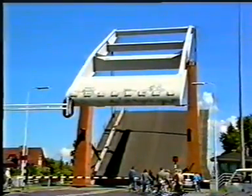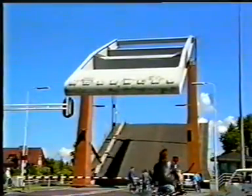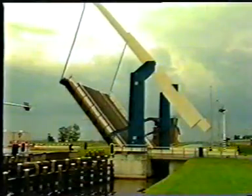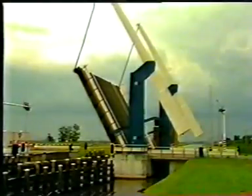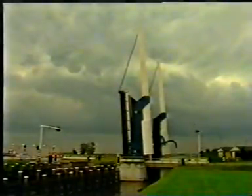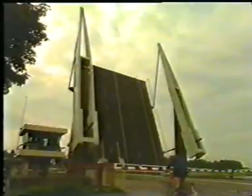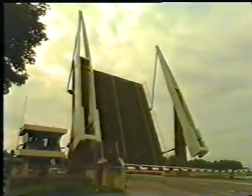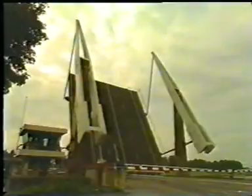In this case, the frame moves in between the columns. The point of rotation is situated immediately adjacent to the column. However, the point of rotation may also be situated above the column, which would limit the angle of opening of the bridge severely. For this reason, an offset column is used. In bridges with an orthotropic deck, separate balance beams are used. The bracing is missing. By separation of the balance beams, more counterweight can be installed. The beams are constructed like box girders.